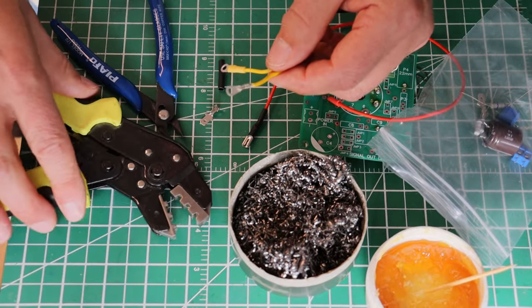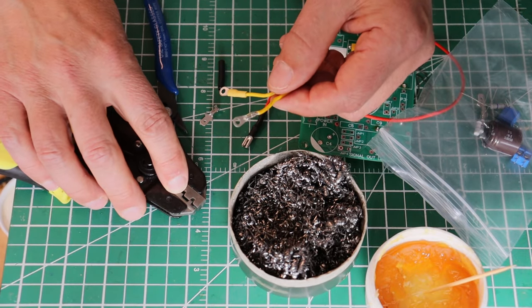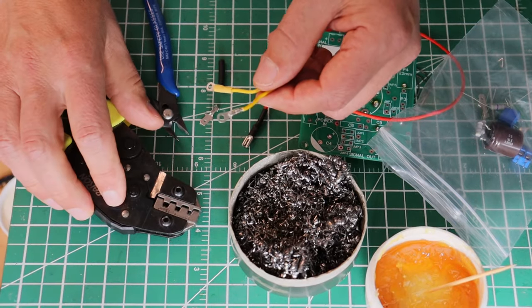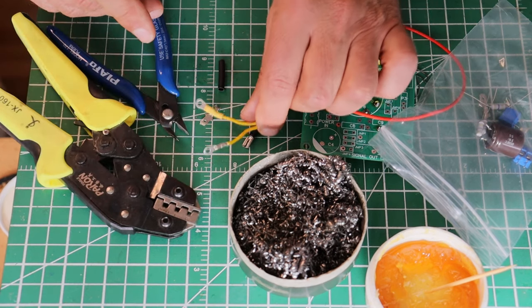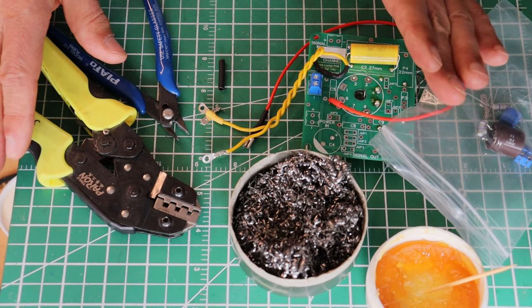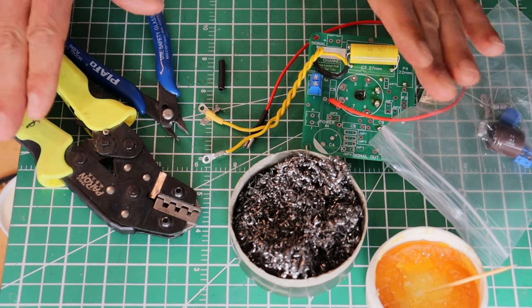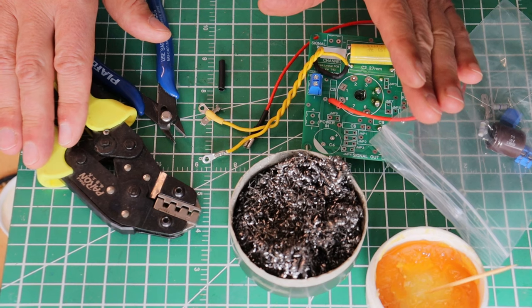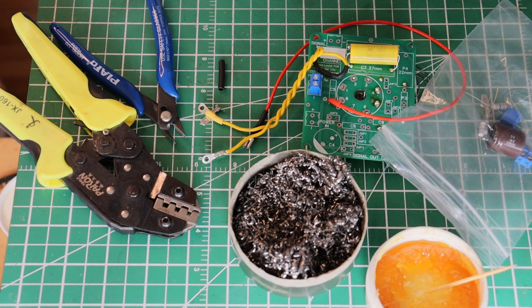Get on the right die. Depending on your terminal and wire size, it may mean starting in the medium size crimp, and if it's a really small terminal you may start over on the smallest. The right die for the right terminal for the right wire gauge. After you've done a few crimps with your terminals, you'll be absolutely a pro. Finish up your kit of parts and practice, practice, practice.